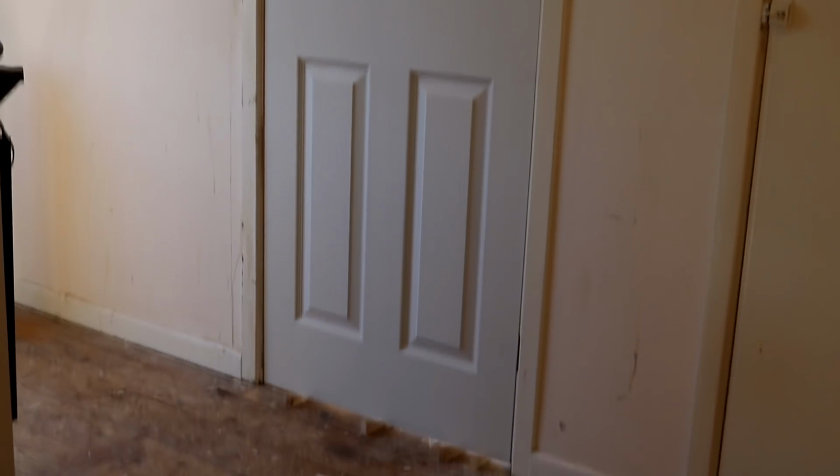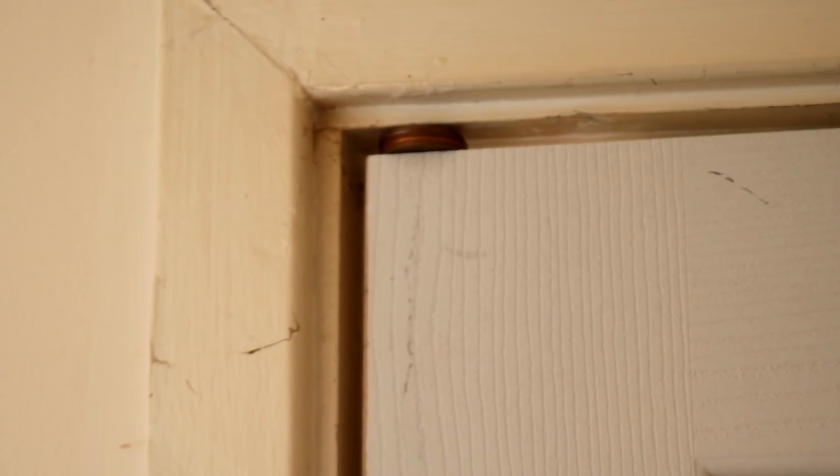Then onto my next door, and I knew this wouldn't be as easy because this was a door frame that wasn't square by quite a bit. So to fix that, I propped the door up, but I had one 2p trapped on the far right and as many 2p's as I could fit into the left gap.